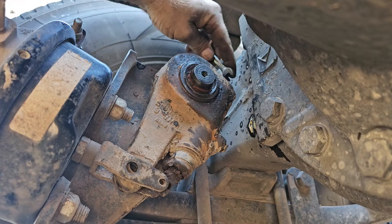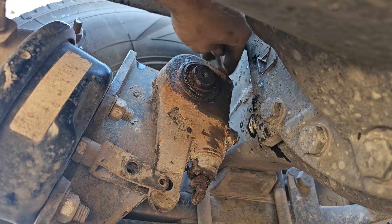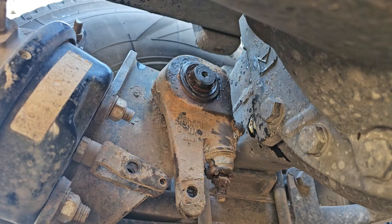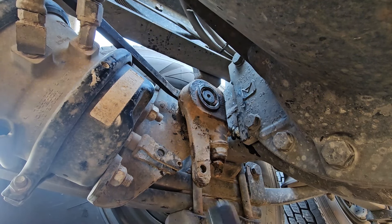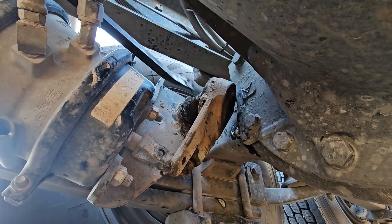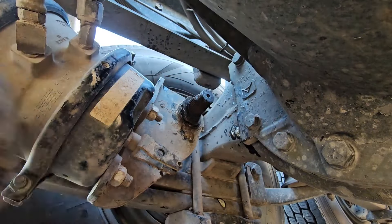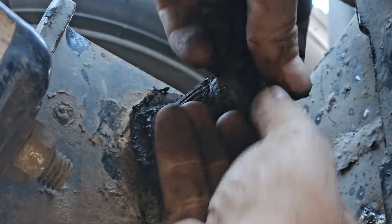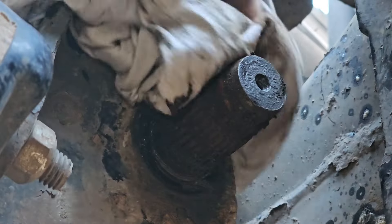To get the slack adjuster out, you just turn the brake adjustment screw — it's a square on the top of the slack adjuster — clockwise, and it'll come out of there. Then you can knock it out of the S-cam. I found you can't just pry it off with a pry bar, so the method that worked best was to pry on it and hit it with the hammer from both sides — then it came right off. Also worth mentioning: there's a washer behind that snap ring. Once you pull the slack adjuster off, there'll be a rubber piece on the shaft — pull it off — and behind that a shim which you want to pull off too.